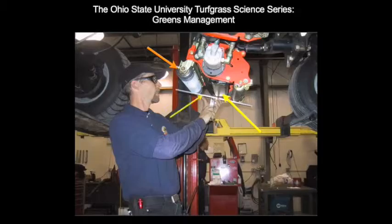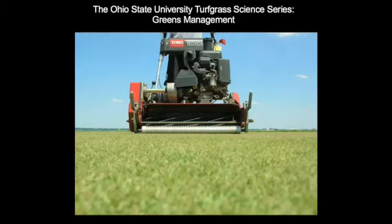In this picture, an accu-gauge is used to set the cutting height. The most common front roller is the grooved roller. The grooved roller pushes slightly down on the turf, allowing for the leaf blades to stand more upright in the grooves prior to cutting. Generally, the quality of cut is considered to be the best with the grooved roller.